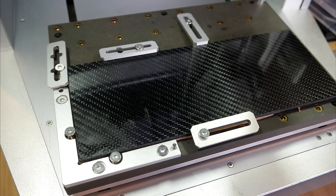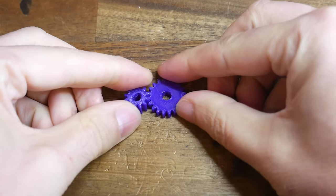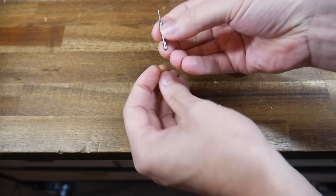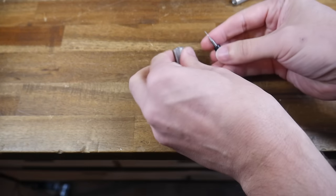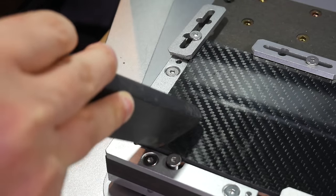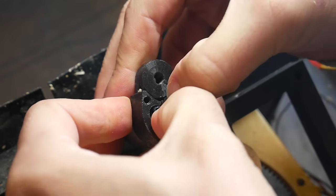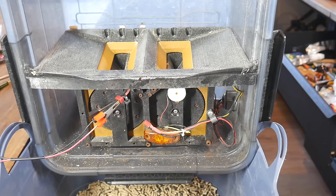How about some carbon fiber sheet? Another thing I cut frequently on the regular Carvera. I designed and created an automatic pellet feeder for my miniature goats, and a small redesign changed the gearing, leaving the drive gear particularly small. Since then I've had a series of failures from this tiny 3D printed gear breaking and leaving the goats hungry. These are tiny gears so I will need a tiny corn bit. To prep it, we have this special tool where we put the cutting bit and a collar inside and twist it, which will press the collar into place ready to go. I was worried about snapping the cutter, so I went pretty conservative with the depth of cut. I did end up snapping it, but that was my fault because I set the wrong thickness of the stock. I did manage to retrieve it and cut a few spares as well as the idler gear, and all of these came out really clean and crisp. Their dimensional accuracy was perfect, giving me a really satisfying press fit.